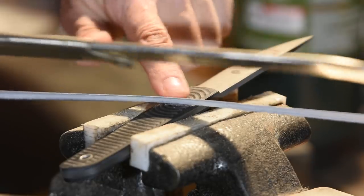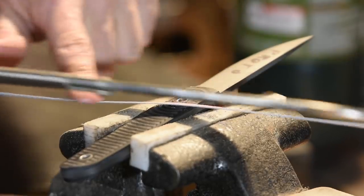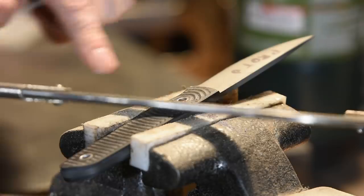If it's a screw you just need to unscrew it and remove the old handle scales. Now there may be thread locker, and in that case you'll need to heat the blade up with a heat gun or maybe even a small propane torch. In a case like this one — where I use tube rivets — you'll need to get rid of the head of the rivet. You can carefully cut on the bias with a hacksaw. Just don't go crazy and run into the tang.